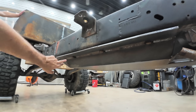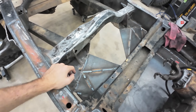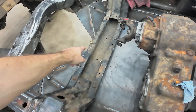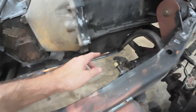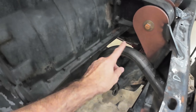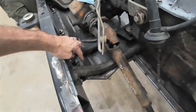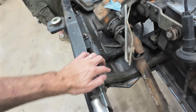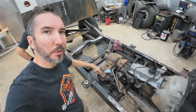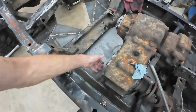We've got more angles here. It's got big giant bolts — three on this side, four on the other side. You can see up top I've welded it all together. It links in on the back here, links in the middle. And it's got angle underneath the oil pan, and it's got these tubes on either side. This one is angled up and over the drive shaft because the drive shaft is going to come up into here. We have a cross member tube here. Today we have to take it off and cut a hole right here. We may need to do a little bit of clearancing for the transfer case, so we've got a little bump out that we're going to put underneath there.